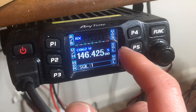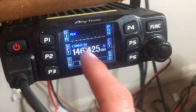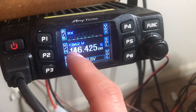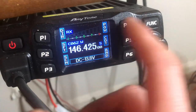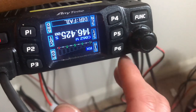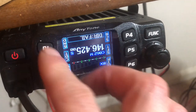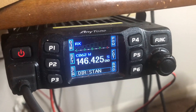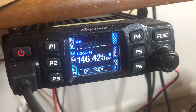The function button goes out really quickly. Then you got your shift button — for two meters it's going to be 600 kilohertz. You want to adjust that there. Don't ever hit the direction button when you're driving, because you're going to hate it. Watch — when you hit direction, it's upside down. But that's actually intentional: depending on how you have this mounted — whether inverted or upside down — wherever you had to mount it, you can flip the display direction. So that's the way you can do it, whatever you like.